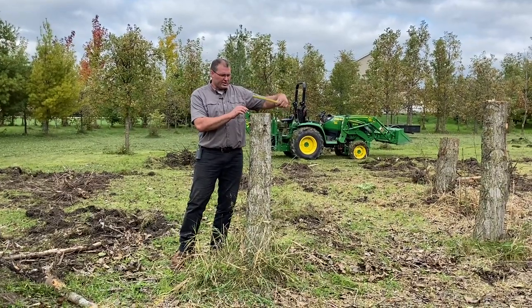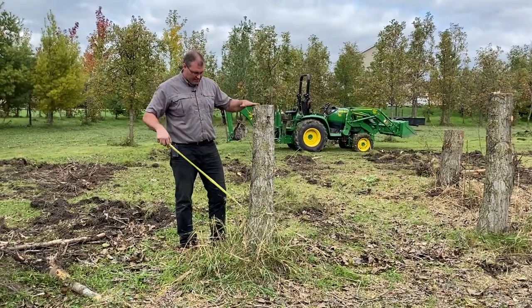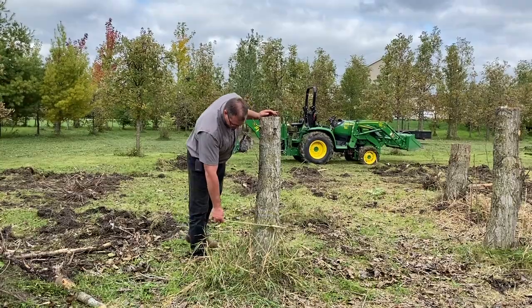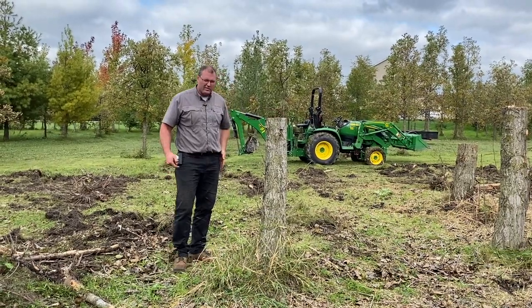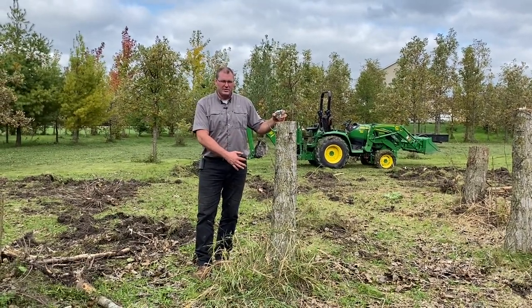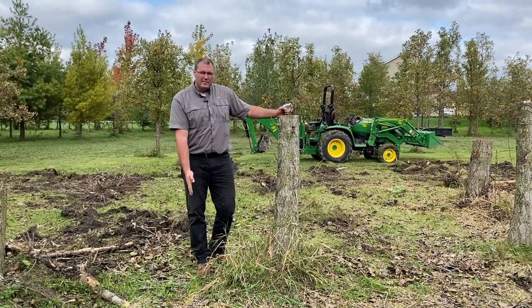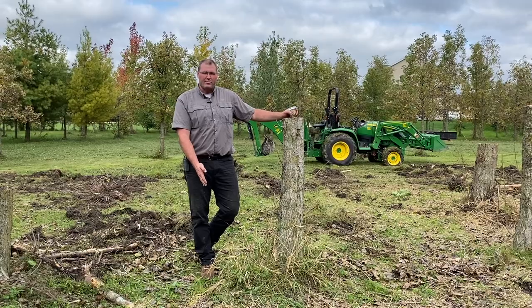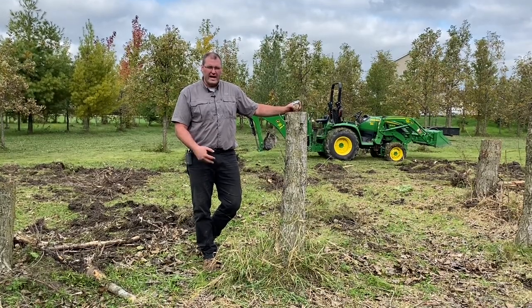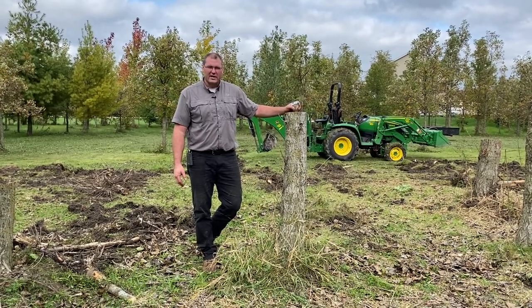To give you an idea, I've got eight inches right here and I'm standing about four and a half feet up. Down at the base I'm looking at probably 10 inches, and then down at the very bottom probably about 12. What I need to do here is I'm not going to be able to just scratch and rip all the roots tight to the base of the tree, because the wood is going to be stronger than the machine. I'm probably going to have to come out maybe a foot and start digging down — at that point the roots have a little bit less strength. If not, we'll show you how to use the teeth to try to break through them slowly, pass by pass. Let's get going on this one.